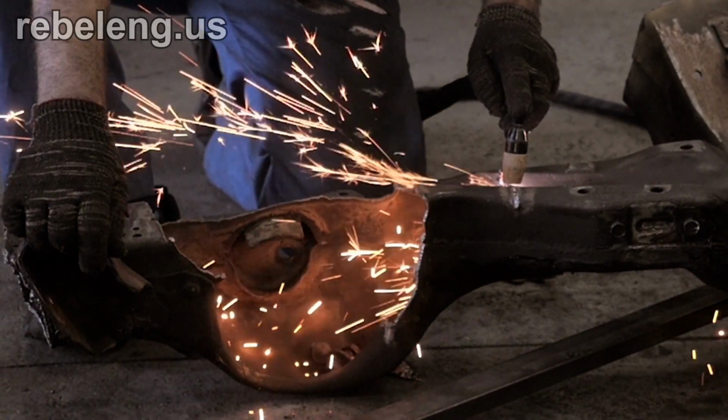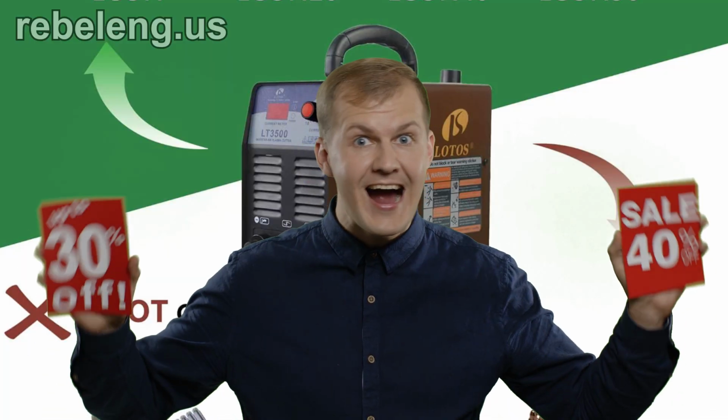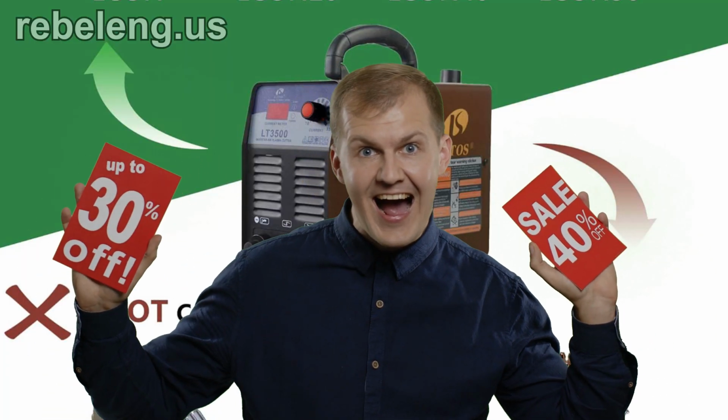In those, you have to scratch the tungsten against the workpiece to start the arc. For anyone who's ever used these TIG systems, you know it takes a lot of extra skill and it eats through consumables. Similarly, scratch start plasma systems have a hard time getting the arc started when the material surface is dirty, rusted, or painted. You can still buy cheap import plasma cutters that use this scratch start technology. There are so many options available that there's really no reason beyond low price to purchase these outdated machine designs.